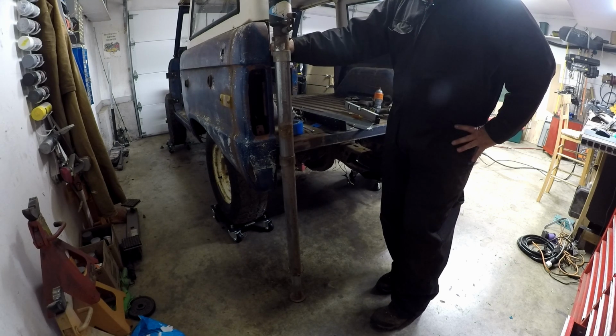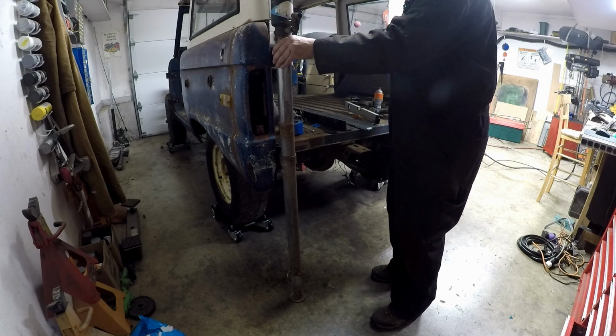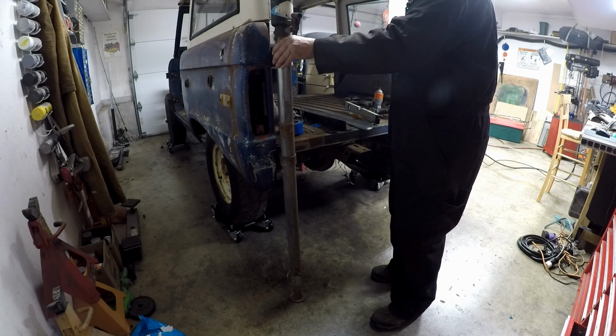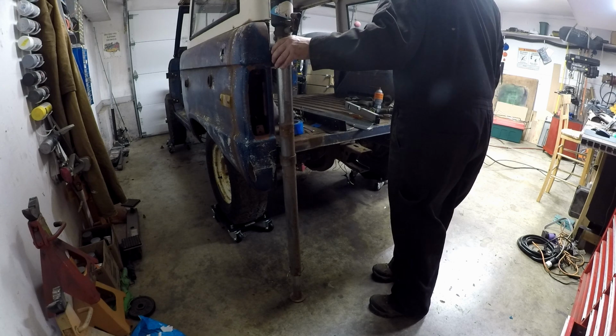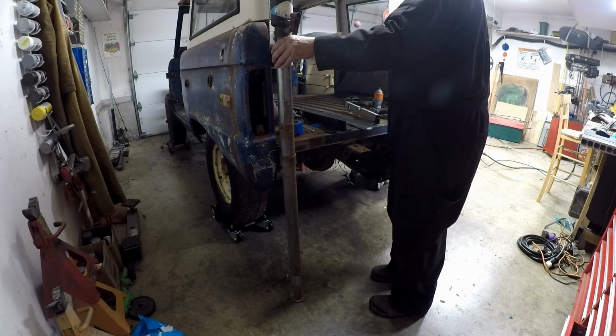I'm also going to go ahead and get some Harbor Freight 3-wheel dollies to weld or bolt to the feet so that the entire top can be wheeled around the garage. The entire body could be scooched around like I have them on roller skates, so the body and the frame will be able to move around independently on the garage floor as I need to adjust them. So now we just have to drill the holes in the brackets, and I have to weld the angle bracket to the flat plates for the other side of this tailgate section.